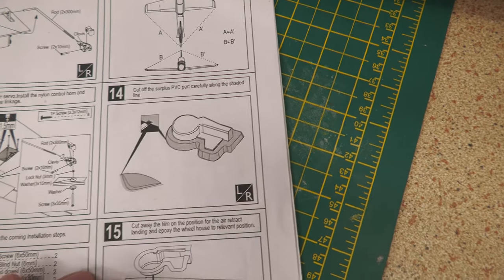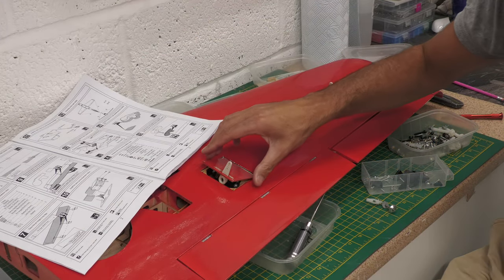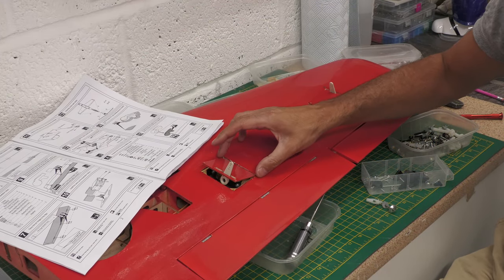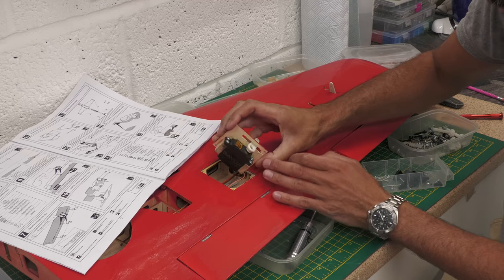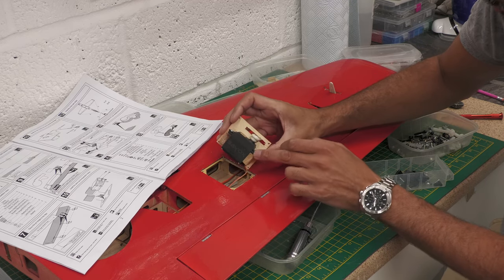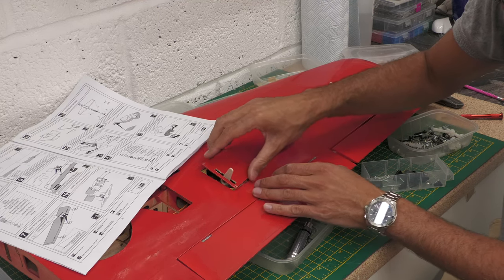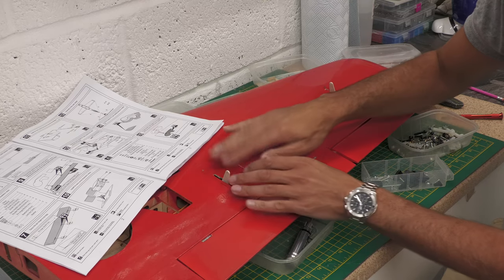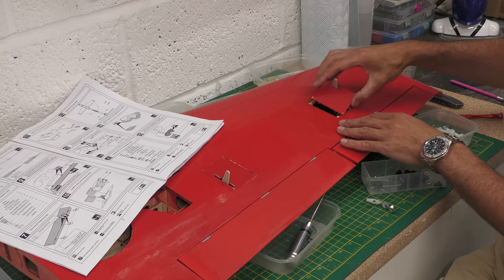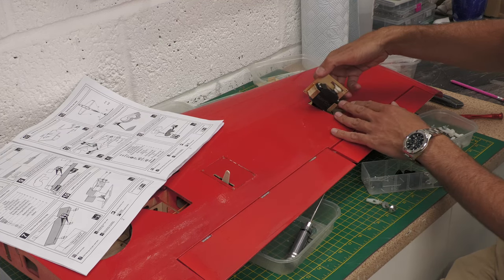Update time. I've pulled out the four screws of the hatch to check these servos over. As you can see, they're mounted to the hatch. I'm going to check all screws, make sure everything is okay, and pop them back in for now. The servos are new and still current spec. I'll do that on both the flaps and the ailerons.